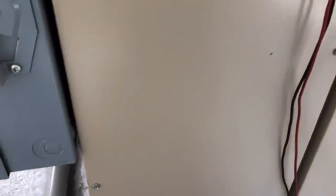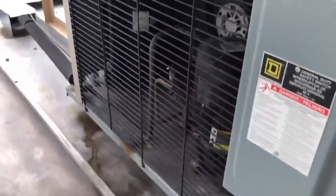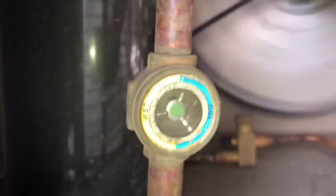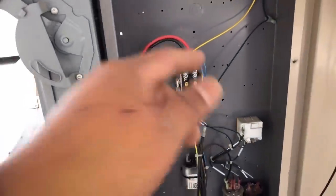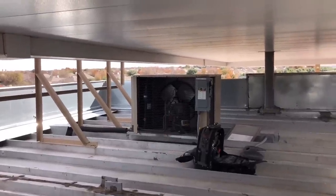These gas stations don't allow us to spend a penny over the NTE. It used to be $500 — I guess after so many times that we left the sites without fixing them, they raised it to $800. This contactor looks pretty bad also — you can see it's pretty pitted. So we're going to go ahead and replace this one as well. It's flashing, so we know fans are running good, compressor's running — this one's just low on charge. We're going to change that contactor as well, and we're going to check the charge on that one too.